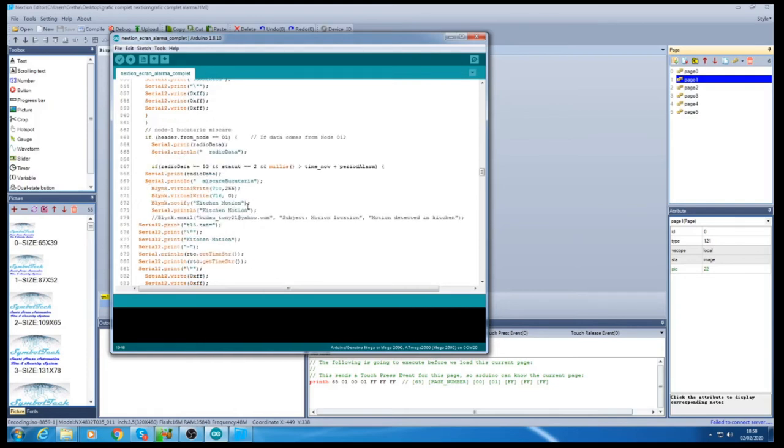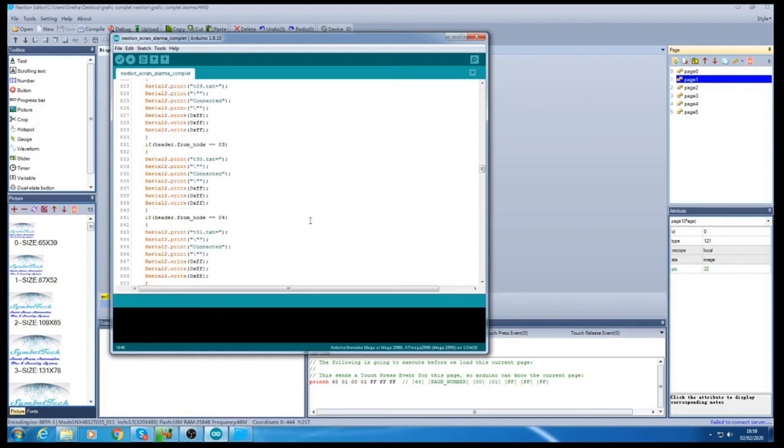Practically how it's working: when detecting smoke, as I said, it allows you 2 minutes to run to the place where the smoke is, and if it's a real fire and you don't reset the panel, it's going to go on full bells. The same also with the motion system. Let's say you just come into the house and forget to scan your fob, and the motion sensors detect it. It's going to beep the panel, like two beeps. And after that, the location where the sensor detected you will appear in the system.